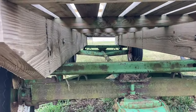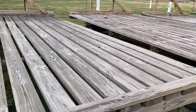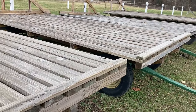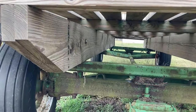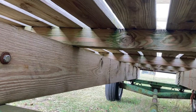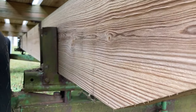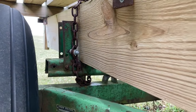It all starts underneath. Some guys overbuild these hilariously, some guys hilariously underbuild them. I use treated pine for all of my wagons. Some guys like to use solid oak or hardwood. The treated pine lasts me quite a long time, and I'll tell you in a couple minutes what I do to keep that from rotting out on top. I use two 2x10s sistered together, screwed together with big lag bolts every 4 feet or so. At the front of the wagon, they are bolted down to the connections on the front axle.